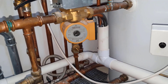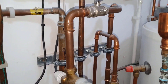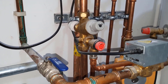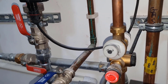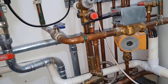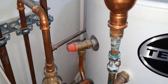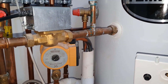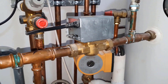If you want to tell me what defects you can see on this installation — this is the cold water inlet, pressure reducing valve, some more pipework there. So let me know what you think is not correct about this installation. That's the temperature relief valve going into the waste there, and you've got the pressure relief valve that's teed into the same point there.